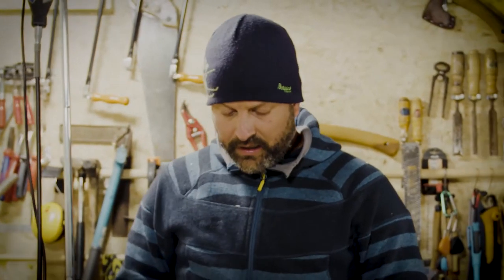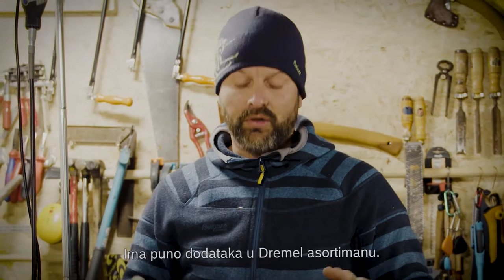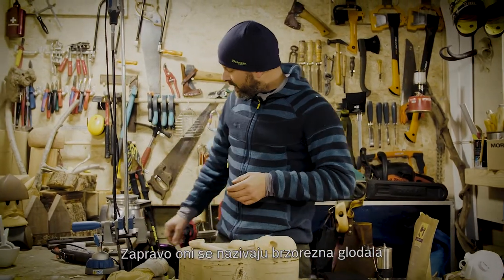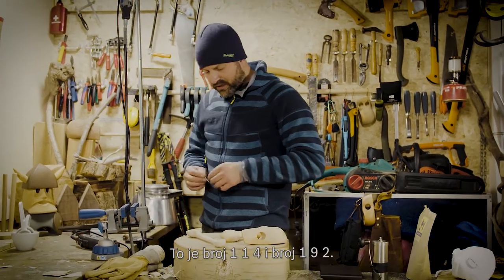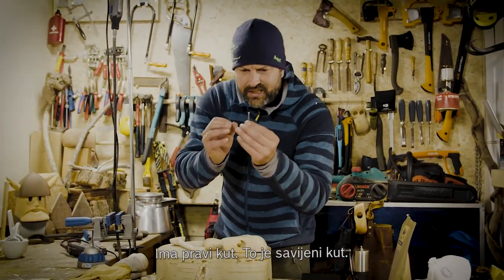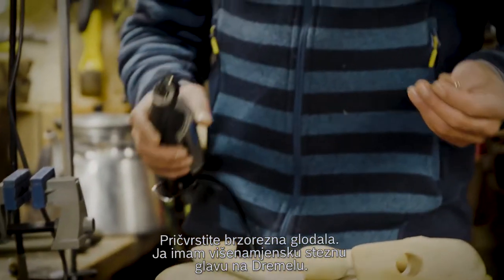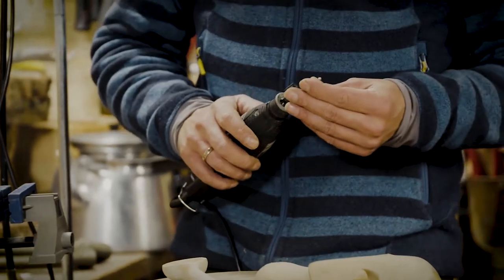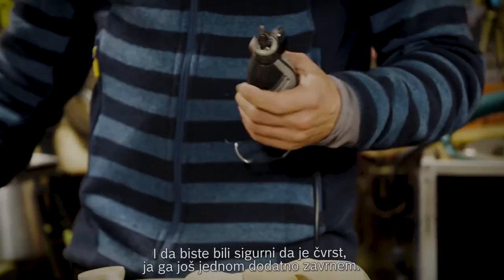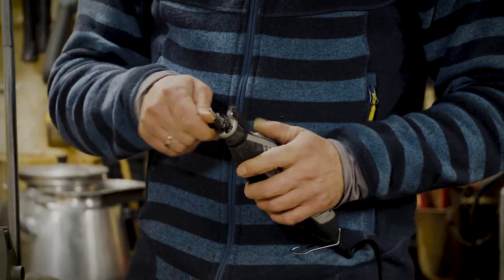As we do wood carving, it's very important to choose the right accessories. There are many accessories within the Dremel assortment. I actually need cutters that really help me with carving — it's called the high speed carver. The high speed cutters are number 114 and number 192. They've got the right angle — a curved angle on all the teeth. To attach the high speed cutter, I've got a multi-chuck on the Dremel, which makes it very easy to change. Put the accessory inside, press, turn it, and to be sure that it stays on, give it an extra roll. Now it's fixated.